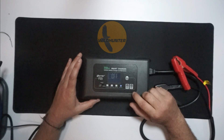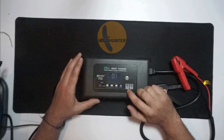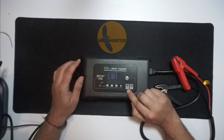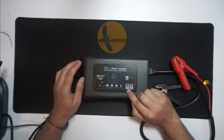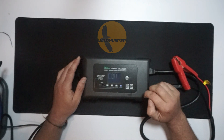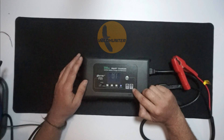If you have a 100 amp battery — a 12 volt, 100 amp battery — and you set this at 35 amps, you divide the 100 by the 35. That's how long it will take to charge from absolute empty, so you're talking less than 3 hours to charge a full 100 amp battery. For 24 volt at 18 amps, you divide 18 into 100 amp, and that's going to give you roughly just over 5 hours.